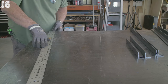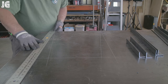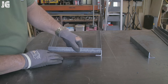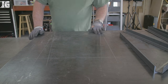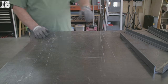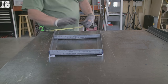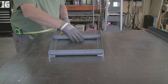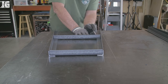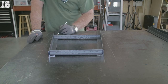I decided to do a little layout on my welding table to help line things up. There are a lot of angles here, and I'm building everything as I go. I tried a layout on the table to get the angles right, and after one mistake after another we eventually got them right. Once I got everything positioned, I started putting pieces together and realized I needed to notch the angle iron pieces for the seat brace and footrest so they'd fit flush all the way around.